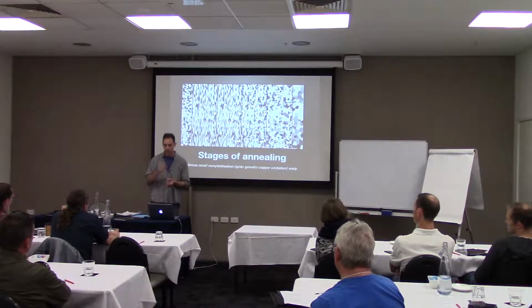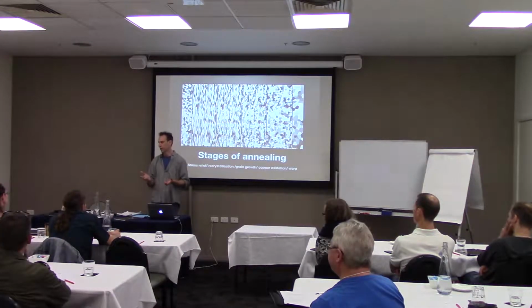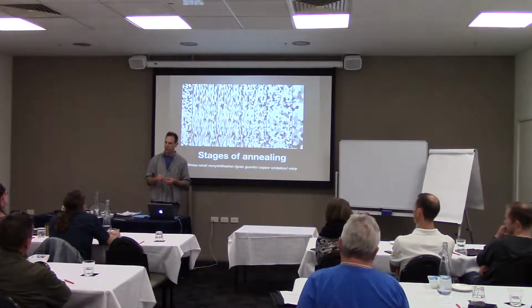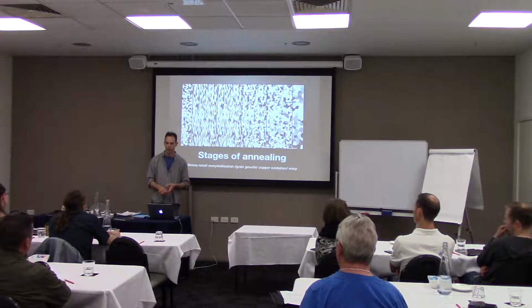And I think it would be a brighter overtone, in my head, because you look at makers that have big, hefty instruments, and you tend to get a lot of vibration exiting the instrument that is pretty forward, as opposed to getting absorbed into the walls. Still good projection. Yes. So from a damping point of view, that's what I think. The more grain boundary you get, the more it's going to absorb vibration. So I think Lawson was trying to get the grain where it was work hardened to a larger grain size at that point.